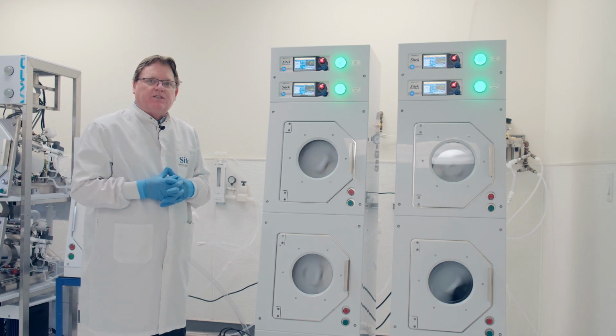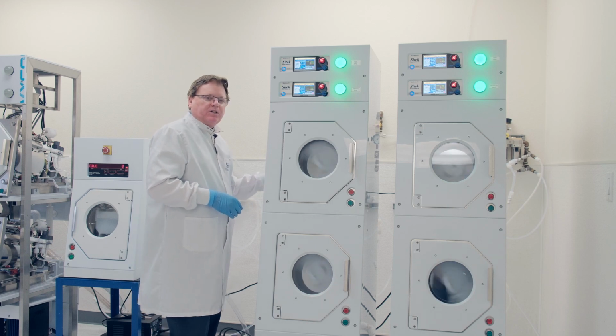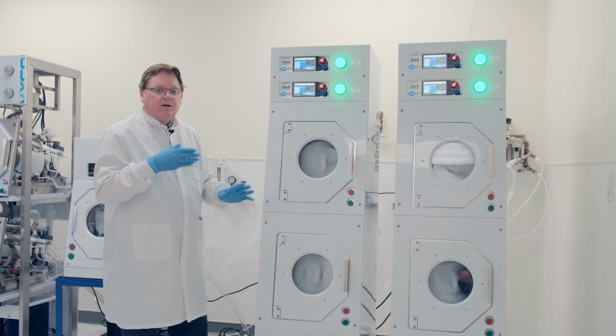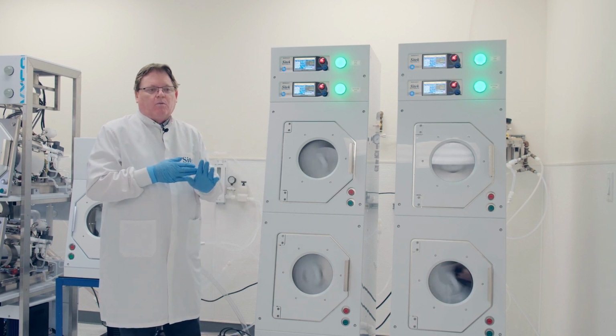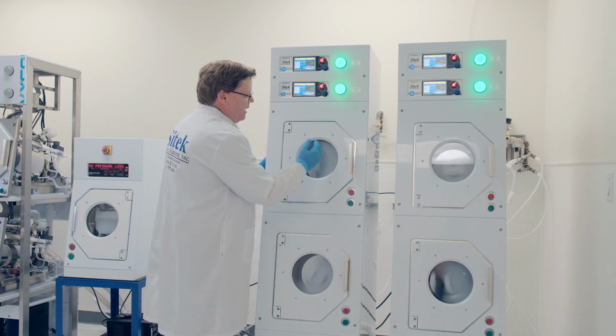Okay, at the end of the process, what's going to happen is back in behind the system, inside of the head assembly, it's called the rotor stop positioner, or RSP. It's going to fire out, make contact with the cam assembly, and roll to a specific place we call home position. That'll upright the wafers at 12 o'clock.